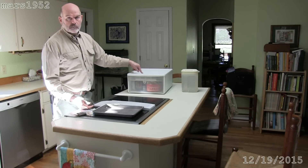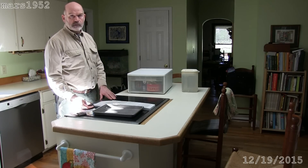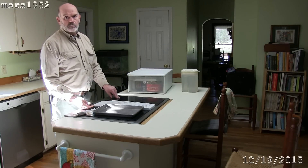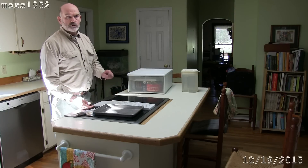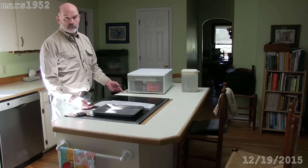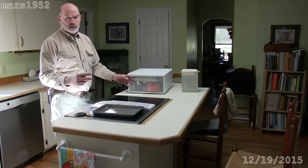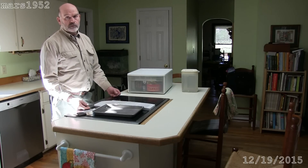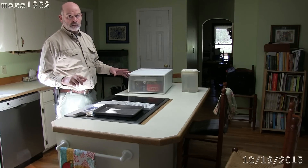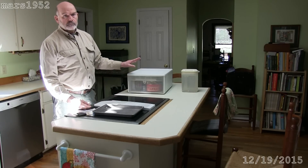Recap: Check the symbol on your plastic resin and look up the melting point. Preheat the oven to below the melting point — I usually go about 20 degrees Fahrenheit below. Turn the oven off once it's hot, then put your piece in. If you try to put the piece in while the oven is still on, the elements will glow, you'll get radiant heat on the plastic, and it will melt and bubble irregularly — it's not going to be faster, it's just going to be worse. If you have the temperature above the melting point, it'll look pretty good and then it'll just start to sag and you'll have a big nasty mess in your oven. So keep the temperature down.